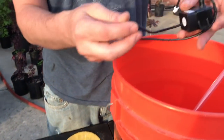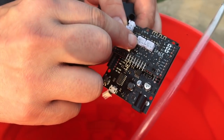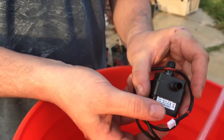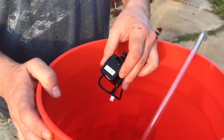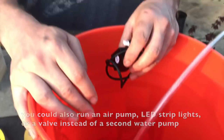If we were going to use the second pump to create more power, we'd just glue it down somewhere close to the first one, take the other end and plug it into the second pump channel of the board. On the board, this is where we plug the first pump in, here's where we plug the first level switch in, and here's where we plug the second one into these two left pins. We don't need dual pumps for this particular application. Typically you'd drop another pump in, run another tube, and join them together for dual pressure so you can water a larger number of plants off the same soil moisture monitoring.